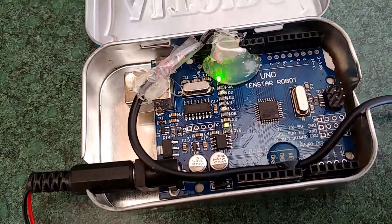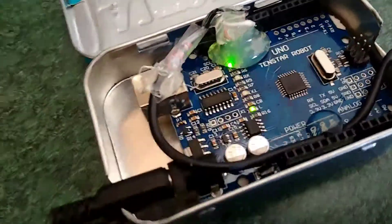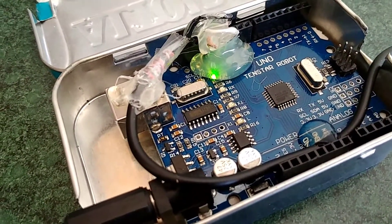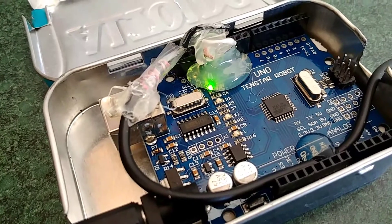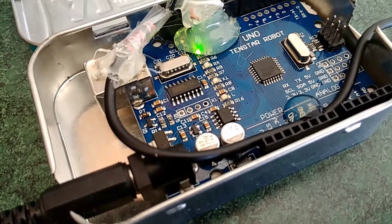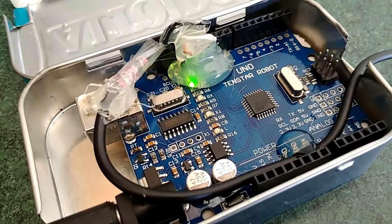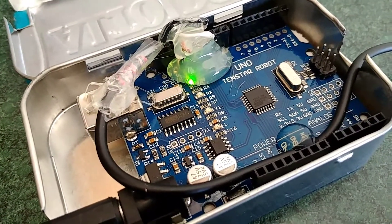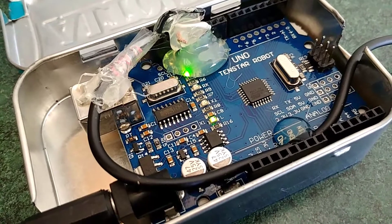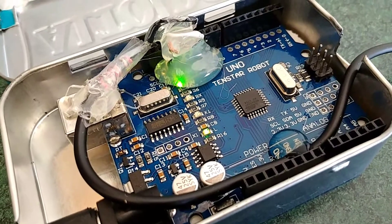The center pin runs to pin 13, which runs the carrier. The sketch I downloaded originally shows pin 9 is running the tone, but I moved it over to pin 10, and I shorted pin 10 to pin 13 — no extra capacitors or resistors or anything like that. I just straight up soldered pin 10 to pin 13 to short it out, to be able to broadcast the tone straight into the radio.